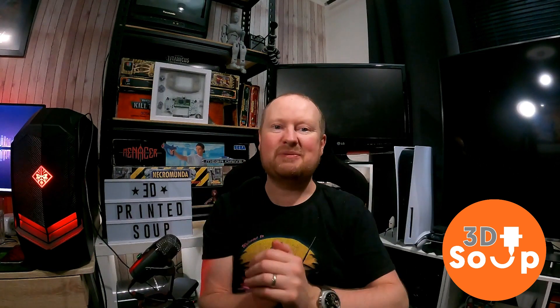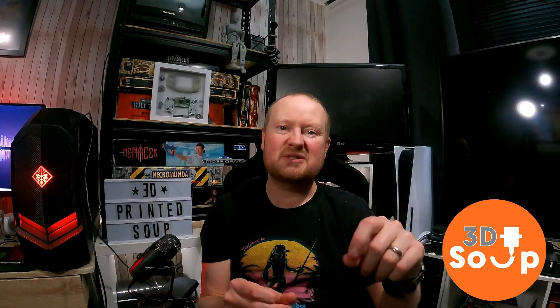The auto leveling is brilliant. You do still need to do the calibration where you slip cardboard under the hot end if you want to get it perfect. However, on my first print — the handle — I didn't do that. I just put it together straight out of the box, ran the auto leveling, and it printed absolutely fine. The other prints came out better once I fine-tuned it a bit, but this is a straight-out-of-the-box calibrated printer and I'm very impressed.